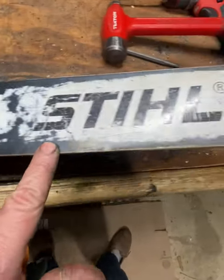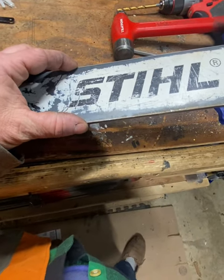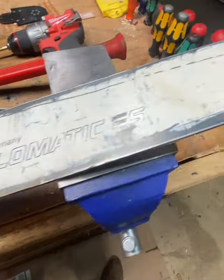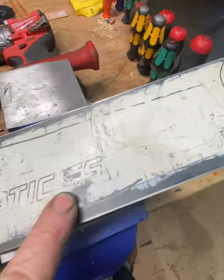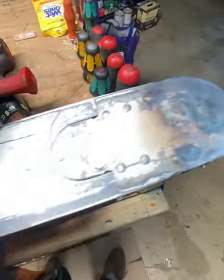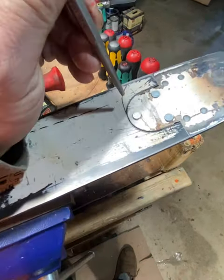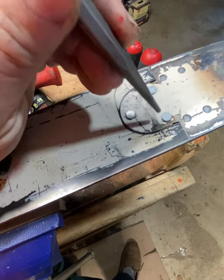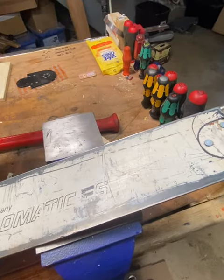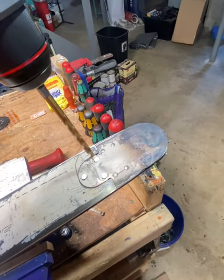Here's the bar — it's been well used but we keep it in good condition. We file down the edges every so often to keep it smooth and guide well. The existing sprocket right here is completely frozen solid. What we're going to do first is take the chisel center hole punch, find the dead center of each rivet, and punch all three out. Once that's done on both sides, take your drill and drill them out.